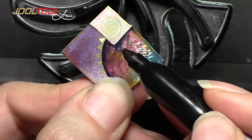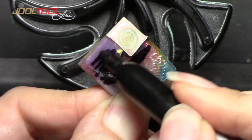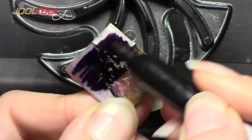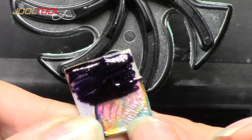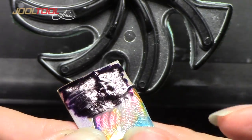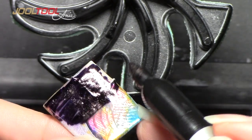So I'm going to go ahead and darken the surface — this will allow you to see where you are grinding, to make sure you've gotten the whole surface smooth. You can see how lumpy that surface is, and we're going to get the metal running through there all in one shot.